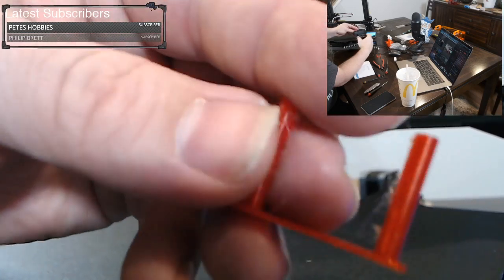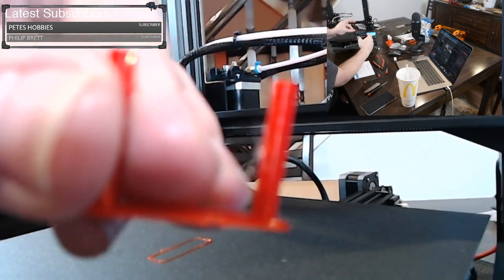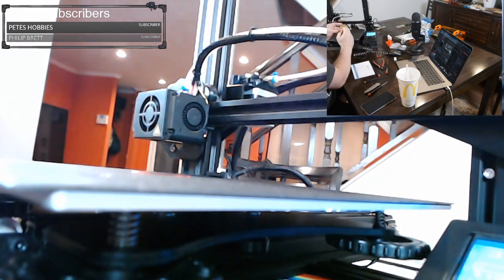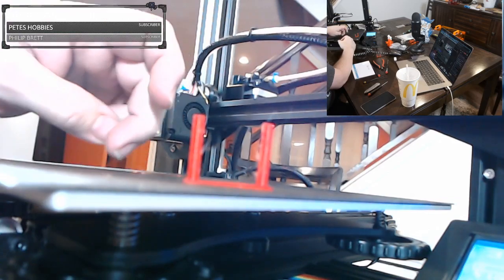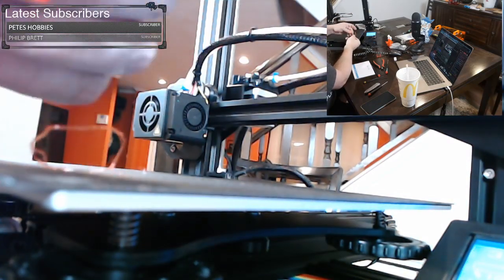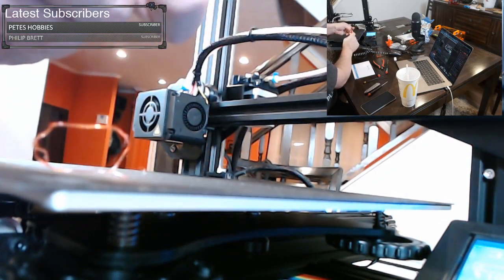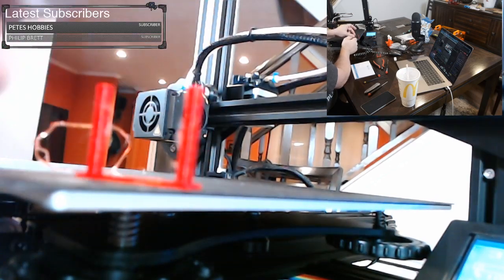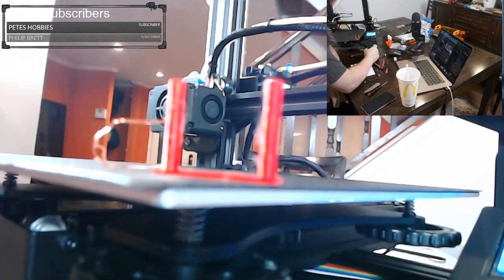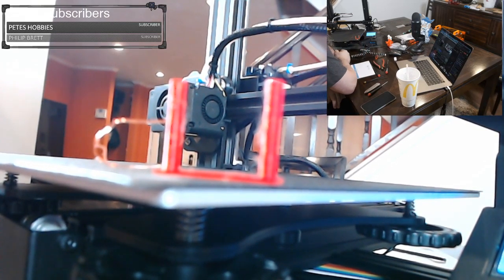Now this one also has a little dot there. I don't know if that's showing up. And maybe a little rough dot right down there on this one. Those are potentially more serious. Like this wispy stringing, you can just pull off, or you can use a heat gun to get off, and you'll be fine. But these thicker dots, they're not going to work with a heat gun. You're going to have to clip them off or something. So those are probably areas of concern. All I would do is change the profile to maybe go to 5.5 millimeters, and then you're probably good.